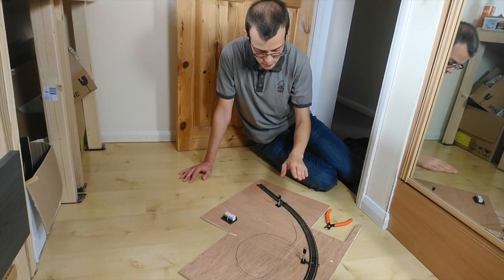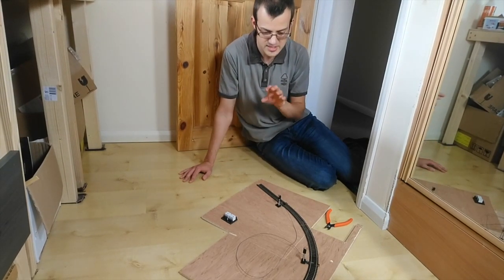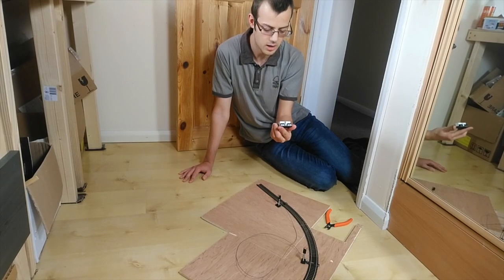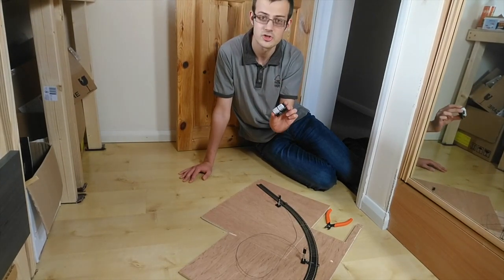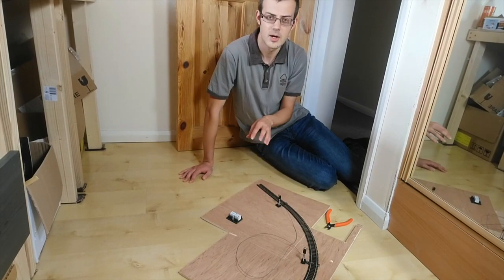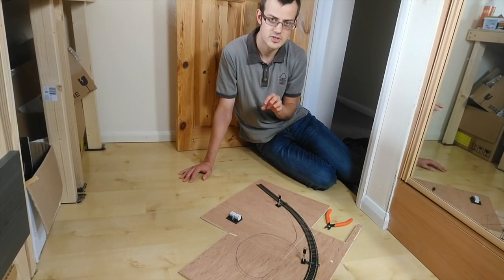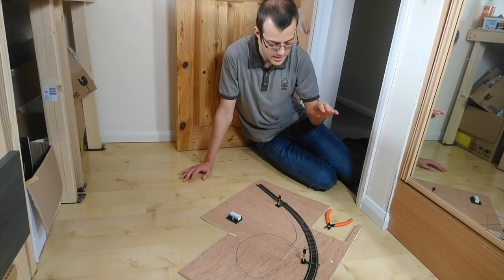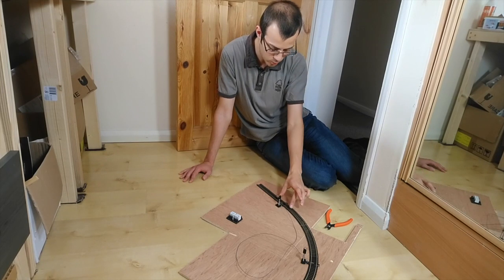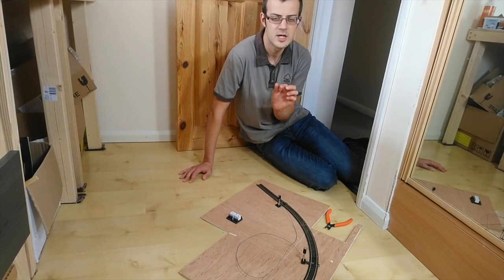I have set up the two sensor signals again with the wire connecting them in exactly the same way as they were on the layout in the last video. The difference is that we're going to be adding control from this — the TrainTech RL1 relay controller. This is going to cut the power to the rail when the signal is on red. The first thing you need to do is cut the rail and create an insulated section — a little block section — on the inside rail nearest the signal at each signal point. That is where the power is going to be cut.